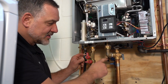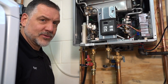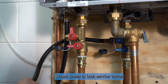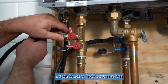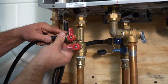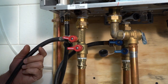These are your service ports — the smaller blue and red valves. We're going to go ahead and remove the caps, then hook up clothes washer hoses to each and open them, essentially draining the heater. We'll get both hoses connected, get the other ends into a bucket, and then just open them to drain the heater. We'll let it drain for about five minutes to get everything out.